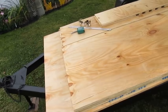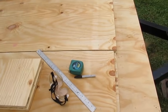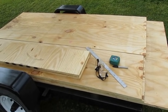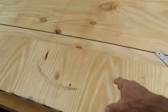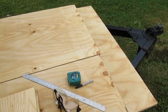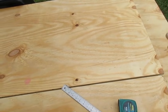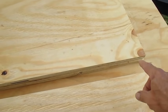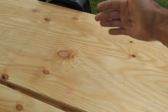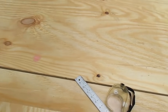Sandy and I went to Home Depot and I got all my wood. I got four sheets of three quarter, four by eight plywood, and two of them already got cut. This is the leftover ends I have, because each board I took a foot off of the length to make it a seven foot piece. And then two of them got ripped to 30 inches — two and a half feet — because that makes up my five foot width, so my seam runs right down the center of the trailer, just like I've done on all my other builds.